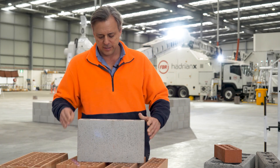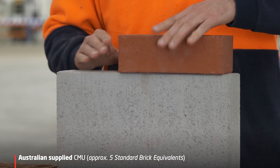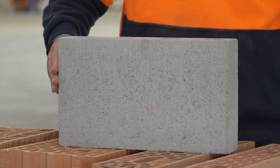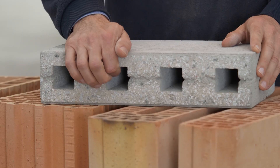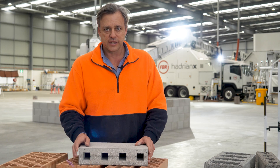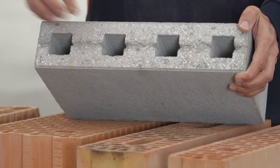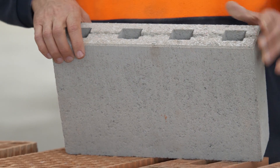When we look at the CMU you can see it's quite a heavy block. It's equivalent to five standard brick equivalents. It's made out of concrete with quite a hard aggregate in it, and it has cores which we do like. These are for running your internal services such as electricity and plumbing. With these wider ribs, when we cut them we end up with a good finish on the ends.